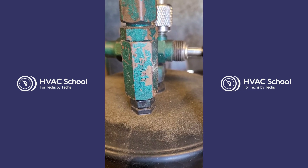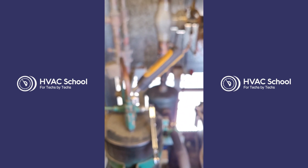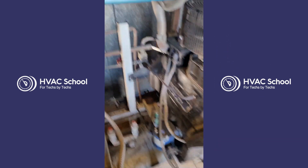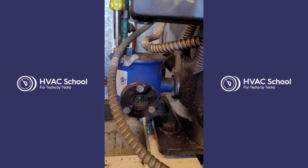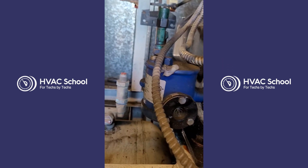Our final step is to balance the oil regulator. To properly do this, we have an OCV-5 check valve, and we must take our pressure difference between the oil reservoir and crankcase suction pressure — which in this case is 5 psi — then plot it on the manufacturer's graph to find out how many turns from the bottom we need to adjust the oil regulator for the proper level. With a 5 psi oil differential, the graph shows it will take 10 counterclockwise turns on the oil regulator from the bottom to maintain a half-full sight glass. These are not instant — it will take a little while to fill up to the proper level, so you just have to monitor it.